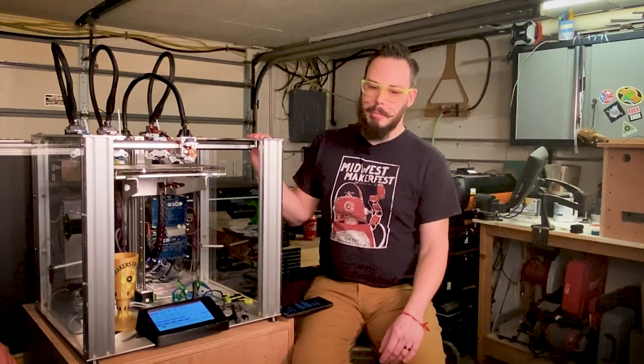And I still would recommend the 2 Wi-Fi over the 3 for this machine, because the 3 is way overbuilt for a 3D printer, for one. It was built to drive large machines. So it's got 4-amp drivers, it's got the TMC 5160s, all the connectors are a lot bigger, and it runs off of the Raspberry Pi 4 for its interface, which is really cool. Yeah, but it's not needed for this